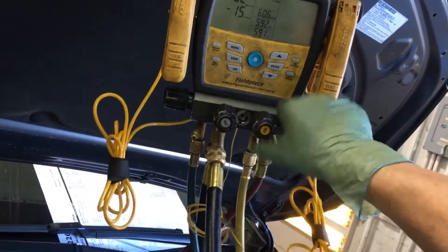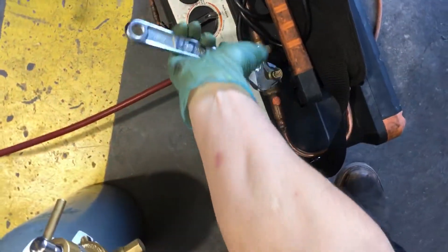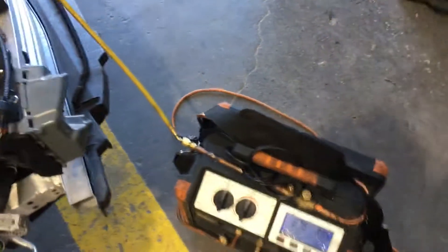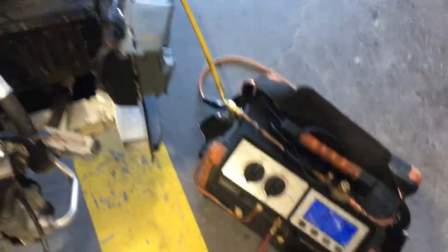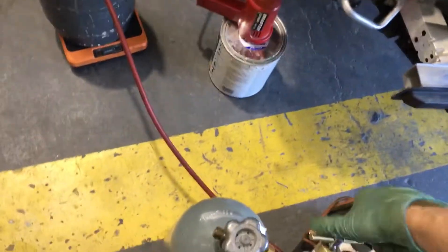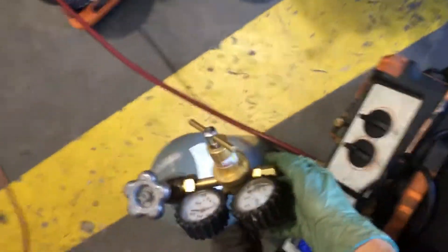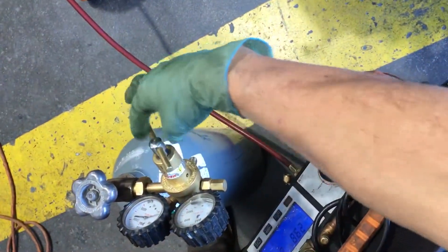So let's go through this procedure. I'll shut off right here — these two are still open. Let me shut off my ball valve and shut off my system there. Go into purge mode. So now I know I'm shut off here and at the end of this line I'm shut off right here. Bringing over the nitrogen — let me back this off, open it up. So now it's open and it will be coming out of here. I'll just crack it down right here — about 10 PSI or so, no big deal.